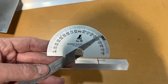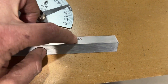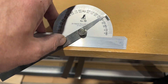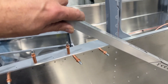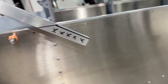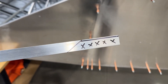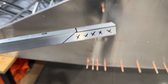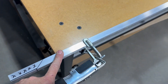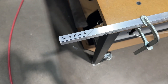I took my protractor and set it to about 35.5 degrees, and I marked back my 2.5 inches for the tang. I'll set this up here, make a mark, and then remove this material. After marking and holding it up roughly to where it would go up to the gusset, that 35.5 degrees is pretty much dead on. I'll trim this out now, file it down, and then I'll have to bend the tang to that 35.5 degrees. I've got my piece clamped down to the work table, and I think I'm going to use my air saw - probably the best way to get this cut cleanly.